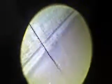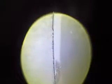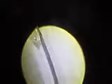This joint's a little tighter. The other ones were opened up about 3/4 of an inch. This is opened up anywhere from an eighth to 3/8. Minor spall at the 8 o'clock position. Once again, the joint is opened up about 1/2 inch to 3/4 inch.